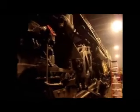And air, like I mentioned, is pumped using these. These are big air compressors. Basically what happens is steam flows down a piston and pushes it down and compresses, and goes back up and fills up the air tank. It goes through the lines there. See, there's one air tank on this side and there's two on the other side, and those fill the tank and allow pressurization of the system.